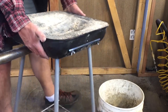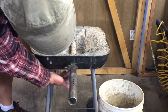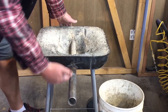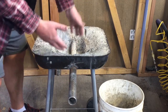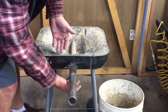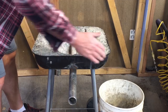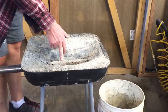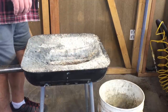I used a five gallon pail to mix it up, and you want to mix it thick enough that you can actually mold it almost like a clay. So I cut a hole in sort of the bottom of the grill, just at one end, and then I ran this pipe through into there. And I taped this up really good to make sure that as I was adding the refractory cement I didn't wind up with cement dripping out of there. So I ran that in there and made sure that it was exposed well enough that I'd be able to get at it and drill holes and so on.